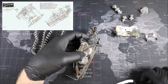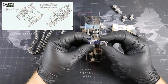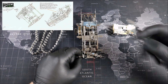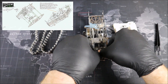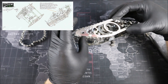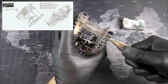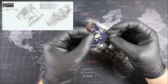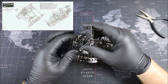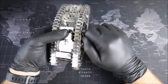The speed adjustment is the part of the build where all the parts you've formed so far get placed into the tank and arranged so they work properly. This is when it's very important to double-check all of your cogs and make sure the teeth are in the proper spot. Once everything is together, it's time to test your tank to see if it can go fast and slow. Put your tank immediately on the slowest setting and let it go, seeing if it will tick through. If it isn't making a ticking sound similar to a clock, something's not right. Start by looking at your speed adjustment to make sure it isn't just sitting on the cog, then check your transmission to make sure the gears aren't slipping off the back. After a couple more tests, mine worked out just fine.